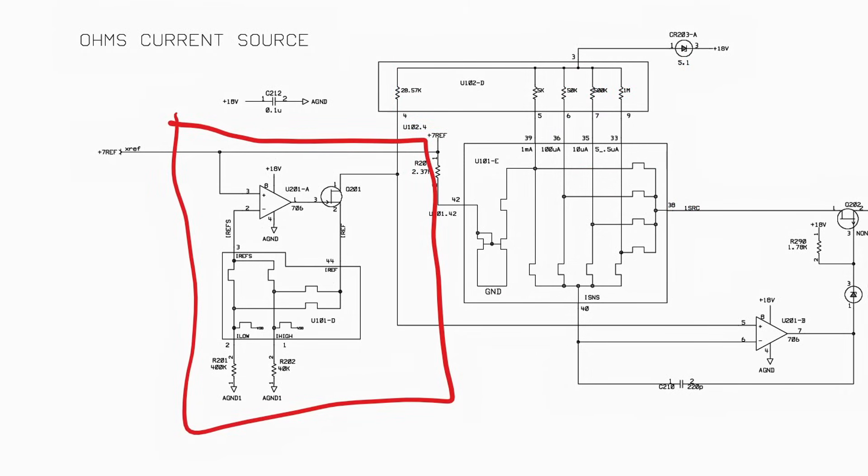This input section has an op-amp and transistor - exactly the circuit I showed previously - and there's a resistor. There's either this resistor or this resistor selected by a switch, so you can choose one or the other. It's exactly the same circuit as before: we set some voltage right here, that goes through the resistor, and it's fed back around to the op-amp input. If this is our V1, then we program V1 here and it goes into the op-amp.